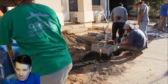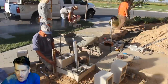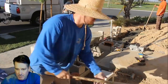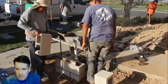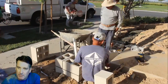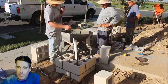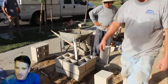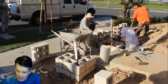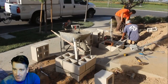For these columns I'm not using the basic 16-inch column block — I'm using regular 16-inch block, and it ends up being a 24-inch square. I'm using eight-by-eight-by-sixteen blocks, so it's a 24-inch square. That's the beauty of the eights — it fits so nicely when you put it all together.